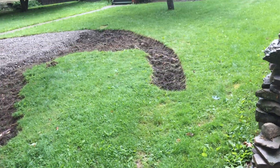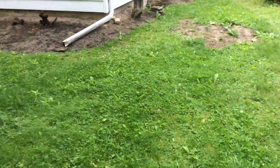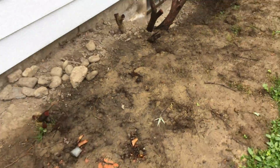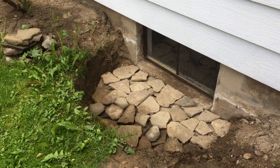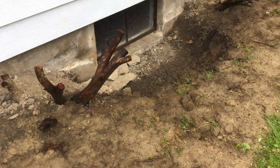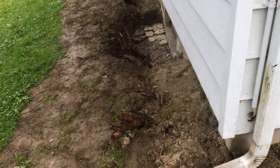We're also working on filling in spots as we pull up the sod — filling in spots around the house, holes, sloping it away and everything else. We're also taking out the window wells, cleaning them, oiling them, letting them dry good, and then putting them back in. Only this time we're putting some stone underneath so they're not touching any dirt. On the outside there'll be stone also, so you're not even going to see the metal — you'll see stone piled up. You can see here's one we haven't done yet, and this is where the first ones will go in.